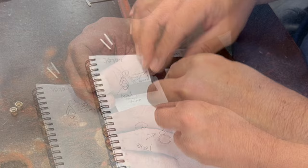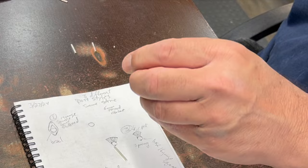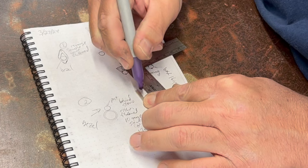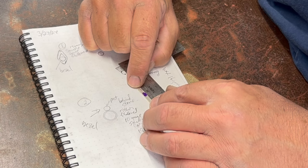So I did these ones about 22 and these ones about 18 millimeters. Spend a moment making sure those get to be about the same length, because they're probably not perfect. A way to get a pretty precise measurement is to color the metal with a Sharpie and then scratch a line where you want it to be cut or filed or whatever.